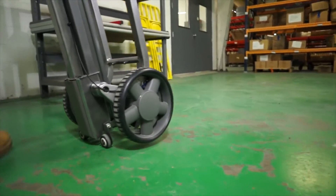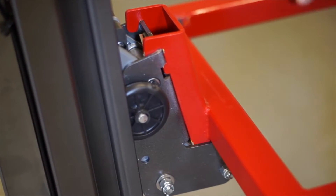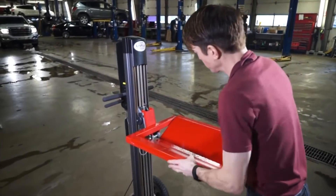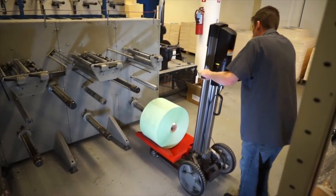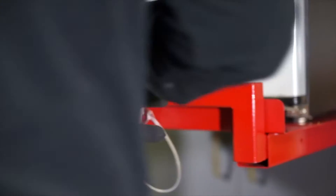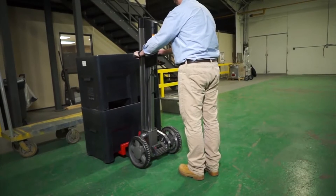We designed it to be very maneuverable and small, so you can get through 28-inch doors. Particular to the LiftPlus is an easy-connect system for a multiple number of attachments, so you buy one unit and can swap out end effectors as jobs are needed. This way you don't have to dedicate five different units to five areas — you have one unit and swap out five different end effectors, which helps with economics for your operations and financial teams.